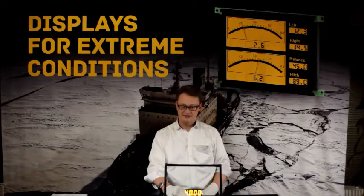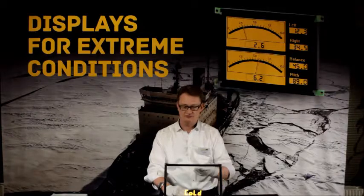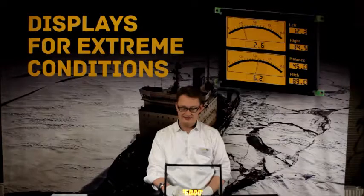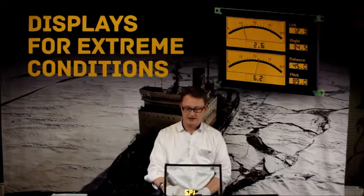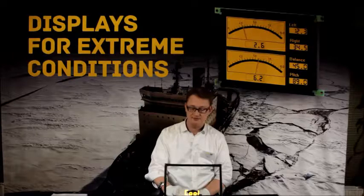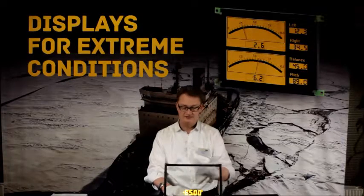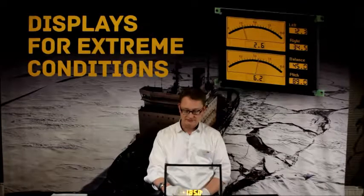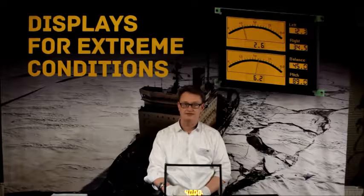Finally, here we have the laminated display sitting in the middle of a laminated glass sheet. So this could be a fragment of a car windshield, for example. As you can see, it's sitting very neatly, very visible. The edges of the display are perfectly blended into the interlayer, so when it's in the off state, it's virtually invisible, and gives you beautiful yellow light. The display is run through the same electrical box that we used previously. Thanks for watching.